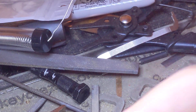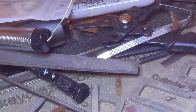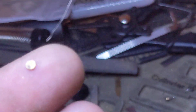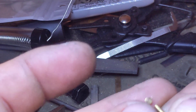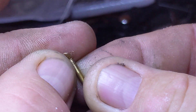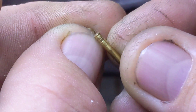So you might want to put a little bit of a wafer — like that little guy right there above it — so if it's above the shear line, the cap is just above the shear line. It'll move a little bit, have a little bit of a drunken movement, but keeps that spring at bay.